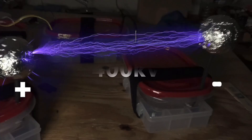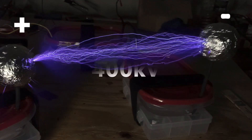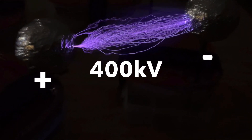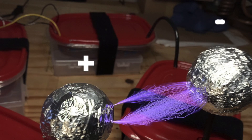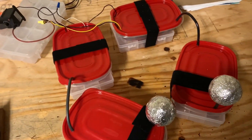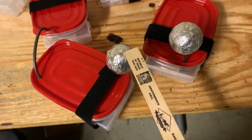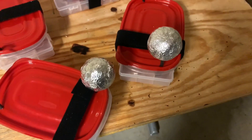So some really long arcs there — that's 400 kilovolts. This setup demonstrates even better what I showed you earlier: you get a cluster of common discharge points on the positive terminal, and you get more random points of striking of the arcs on the negative terminal.